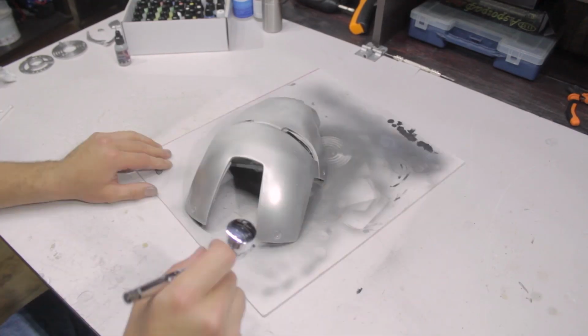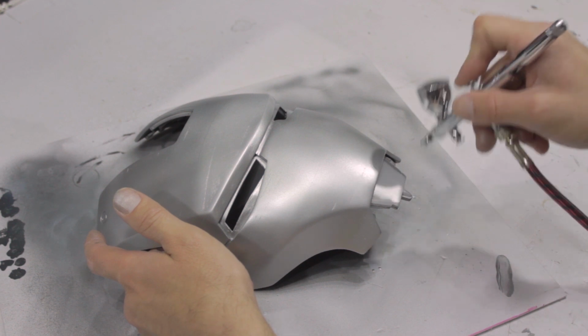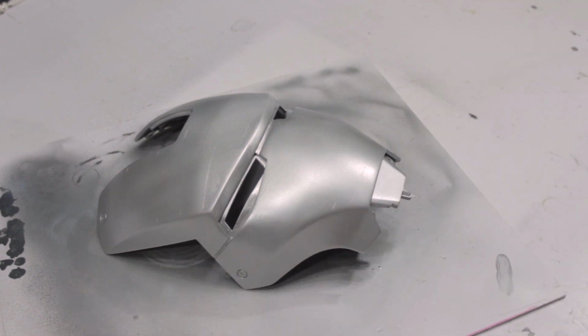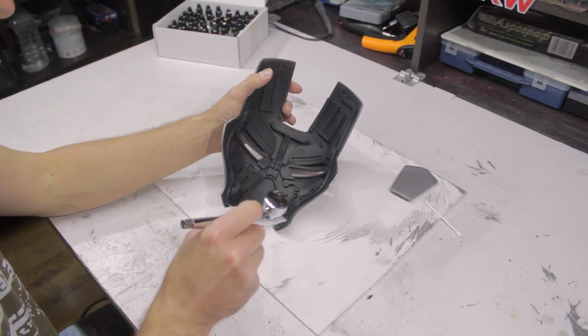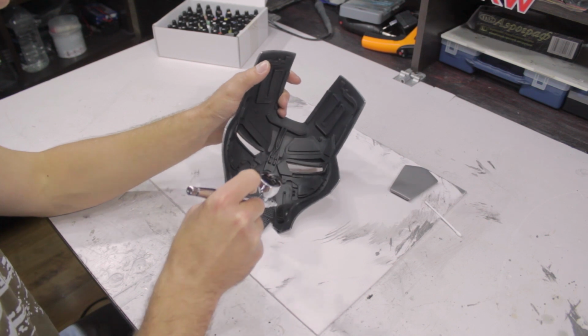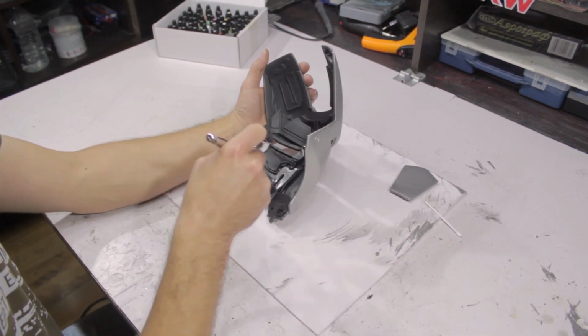Here you can already see the defects on the surface, which were completely not noticeable by touch, and which should have been revealed by a good primer. Of course, I will not plaster, grind and repaint it. It has already taken way more time than I had estimated for this project. Next time I'll just need to be more careful. Now we need only to cover all surfaces with semi-matte acrylic varnish.